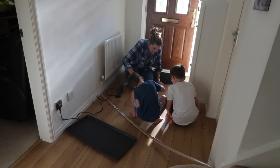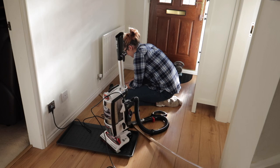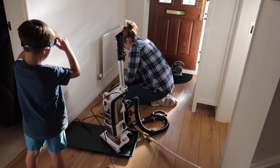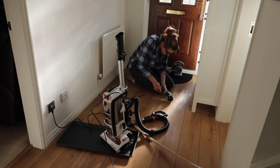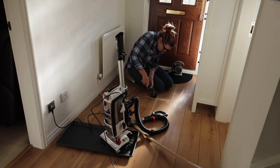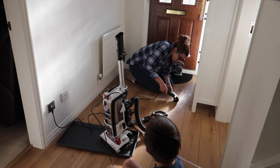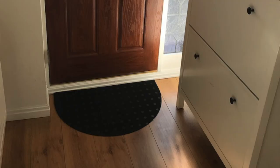At this point I started doing a time-lapse video so that you'd be able to see from start to finish the project. Unfortunately, by the time I had finished cutting across, the camera actually stopped filming, so I'll just talk you through what I did. I did cut the floorboards across and then took up one of the middle ones so I could take up the edging ones. The very edge ones got quite stuck so I got my husband to help me pull those out. We moved the shoe cabinet out of the way so I could get them out properly. Once I'd done that, I hoovered up the area because it was quite dusty underneath, measured out my piece of carpet so that I knew it was going to fit exactly. I then put the strip down in between the two levels — the strip had two parts, the bottom and top, so I put the bottom part down, stuck the carpet down, and then put the strip back so that the join was invisible between the carpet and the floor.